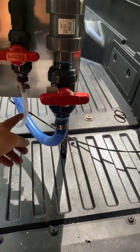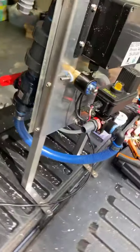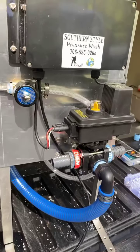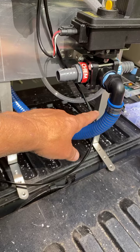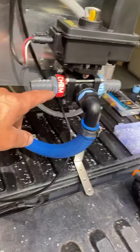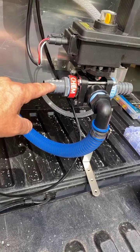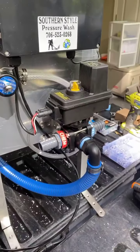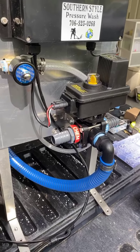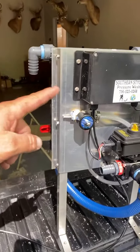I'll add the two hoses and show you the back side of this thing. On these three-way valves — some of them have it, some of them won't. This will run straight to your meter up front. On this side you'll run your bleach from your bleach tank. It says water, so you'll run an extra water line — that's the way the thing works. When you cut this off, it automatically washes out your metering valve.